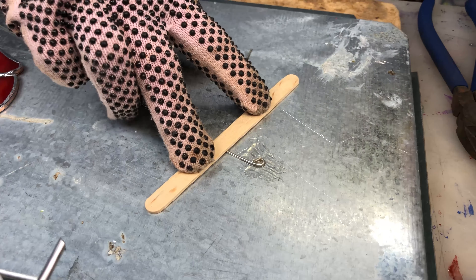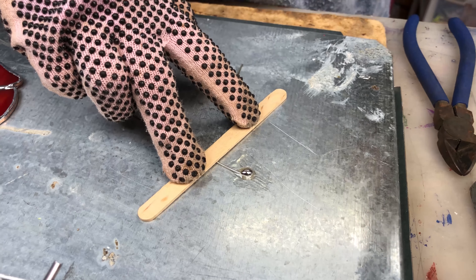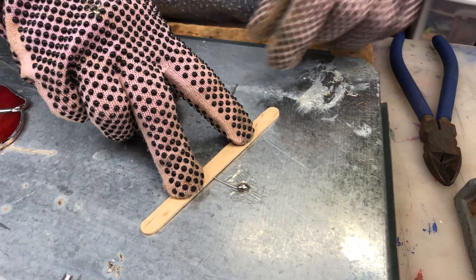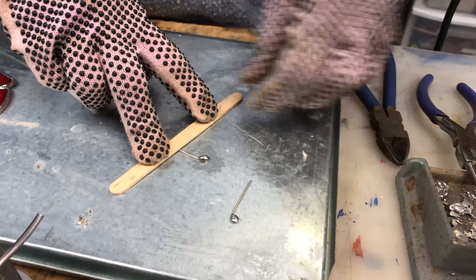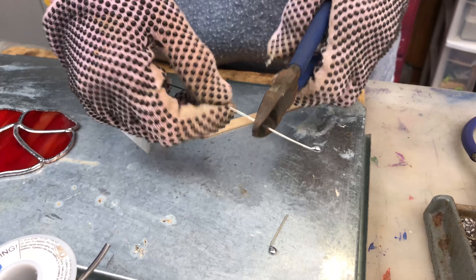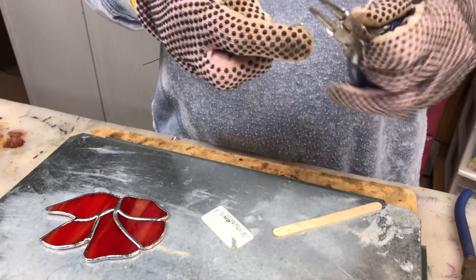You'll see you have this little circle. Now you need galvanized metal, aluminum, or anything that solder will not stick to as your work surface. Take a generous amount of flux, grab some solder, just set it in there and let the magic work. Let that sit a while because it takes a little bit to cool down — if you pull it away too soon it's going to run through. Once you know it's hardened, you can pull it away and you have your nice little end of your stamen or antenna.